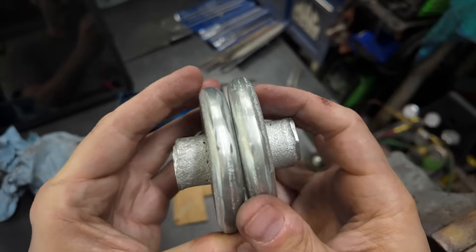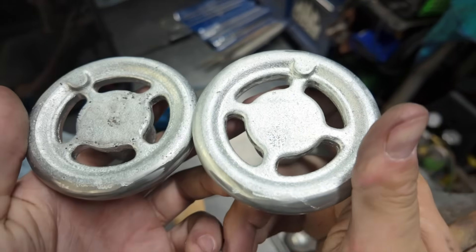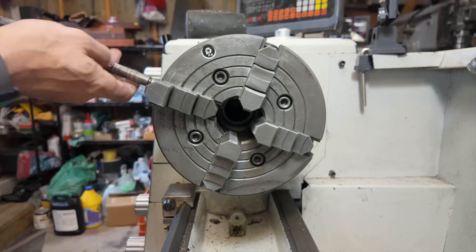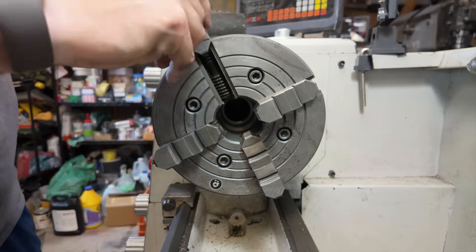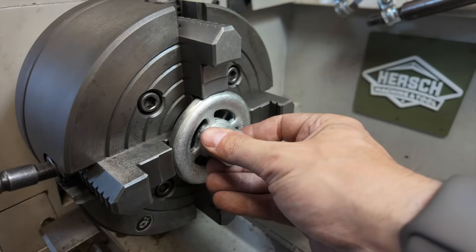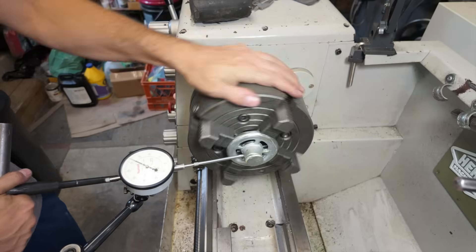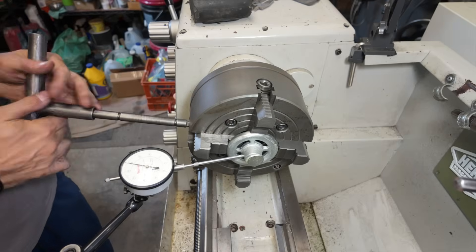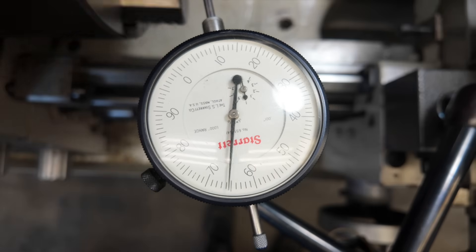After a little bit of initial cleanup and fettling, here's how things are looking — not too bad if I do say so myself. They're really starting to take shape, so I'm ready to move on to machining. Starting over at the lathe, holding onto these is going to be pretty easy — I'm flipping around the jaws on my four-jaw chuck so I can hold onto the outer ring of the hand wheel, giving me full access to the central hub to clean up the outside surface and drill the main bore. I'm able to get it dialed in to within about four or five thousandths, which is really good for a raw casting.